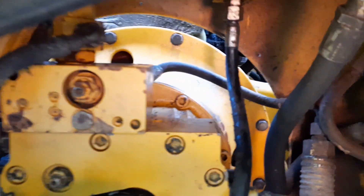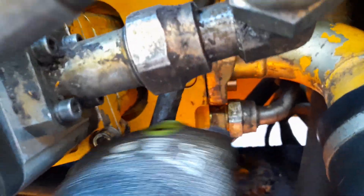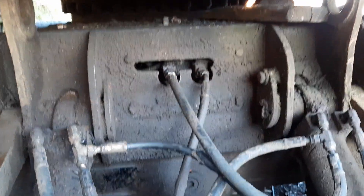I think that's everything in here put away — all the bellhousing bolts in. We've got all the oil lines reconnected, and the cables to this electric pump reconnected. Anything I'm missing is just one bolt off that pipe clamp in there, so I'm going to have a route in the workshop to see if it's on there. I think everything else is thereabouts. Just check that these little plugs are tight — other than that, she's ready for oil. We've reconnected the blade, so that's ready to go.